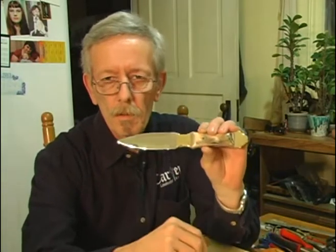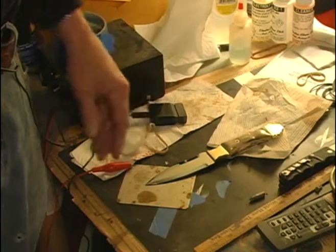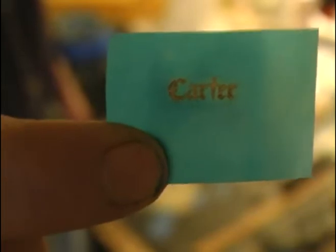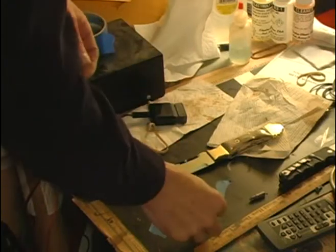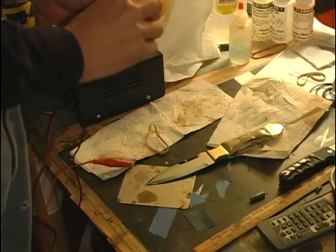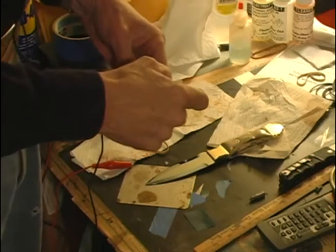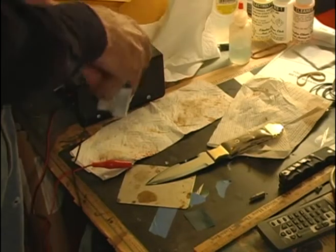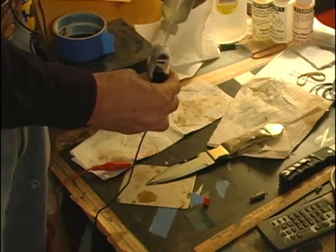So next thing we'll do is put my mark on it. We're going to be putting my maker's mark on this blade. I'll be using the Personalizer Plus Acid Etcher. I've got my stencil — this one happened to be made by Marking Methods, although sometimes I do make my own stencils for special projects. I've got a little felt pad that goes over this carbon element of the etcher, and we need to wet that down with a few drops of this special solution for stainless steel.